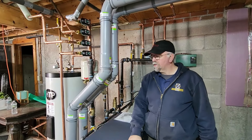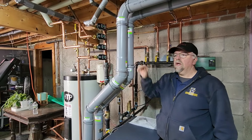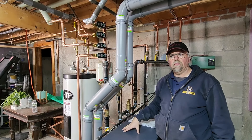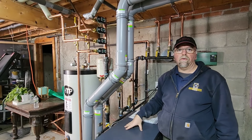According to the instructions, if you do a zone valve setup with these high-efficiency sentry valves, you can use the boiler pump that's in here as your system pump. So you don't have to have an external circulator here — it can all be done through the boiler.